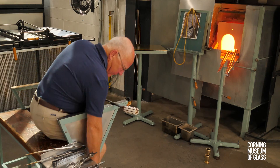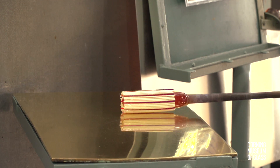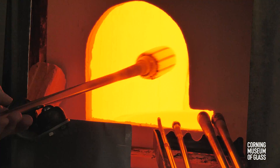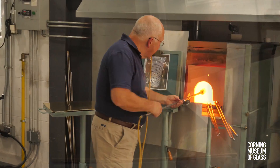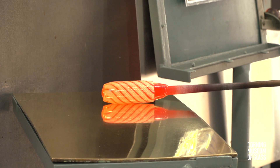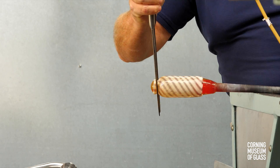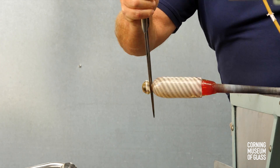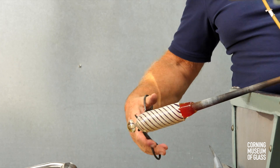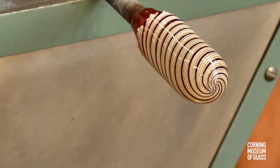The kiln wash has to be brushed off. The glass is reheated and marvered to ensure that the canes and the clear glass stick together. At a certain point, marvering is done in place, and the torque twists the canes. A constriction is made near the tip of the gather. Shears are used to cut free the ball, and this results in a short straight line of cane pattern.